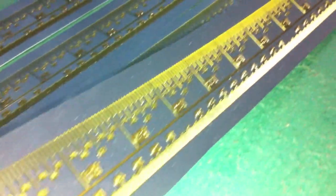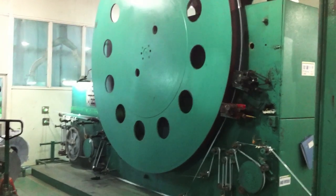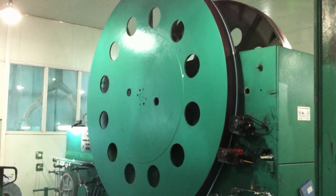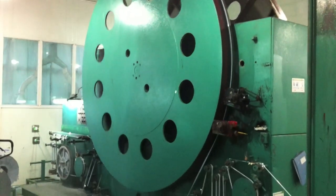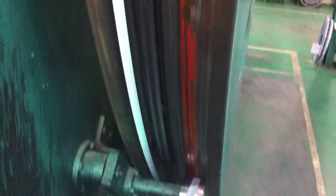We get our Pro Carpenter tape measure print plate, inspect it for defects, and then it gets applied to this large wheel which is a huge printing press — continuous, all 16 foot or 25 foot in one full rotation. There's the blades on there and you can see we're printing two colors, red and black.